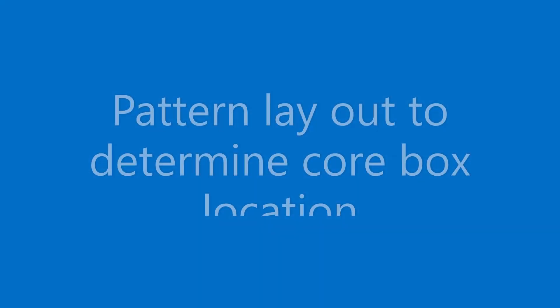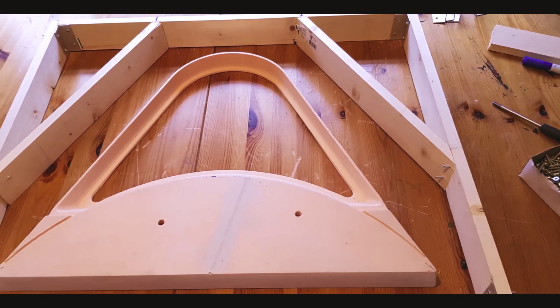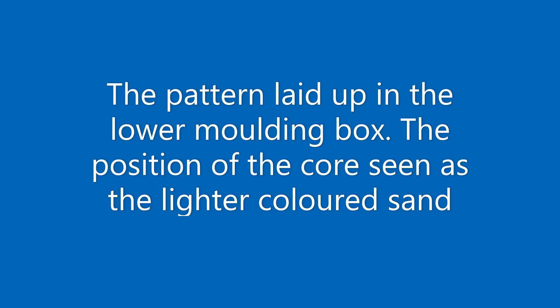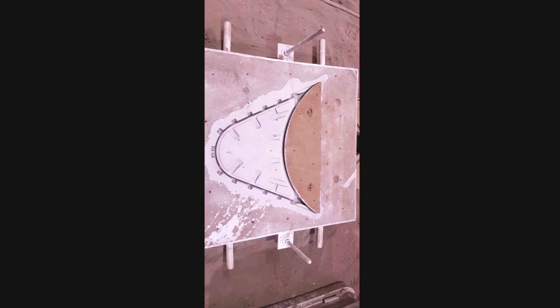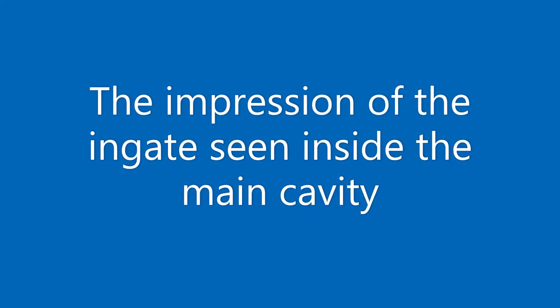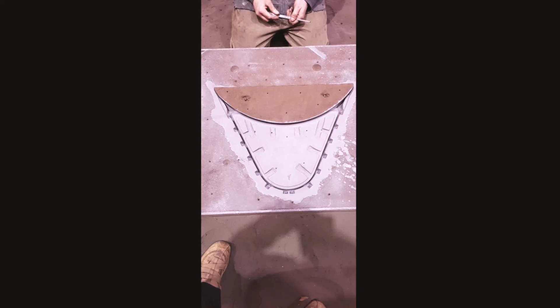The main challenge is that the main frame is of a very thin, deep, 90 degree angle cross section with the front windscreen retaining cover attachment lugs cast onto the outside. This not only presented some very careful CNC machining operations for the pattern but also a complex ingate arrangement for the casting process, required to prevent cold shuts occurring in the mould due to the very thin cross section of the frame. This required a spider gate in the top moulding box to allow multiple feeds in the mould cavity.